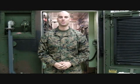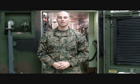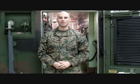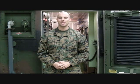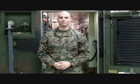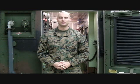I'm an instructor of the Digital Wideband Repair course at the Marine Corps Communications Electronics Schools in 29 Palms, California. Today, I'll be showing you the proper alignment of the 4A1 A22 voltage controlled crystal oscillator, also known as the Rubidium standard. The Rubidium standard produces a 10 MHz signal that's used throughout the TRC-170. It can be located through the top access panel of the 4A1.